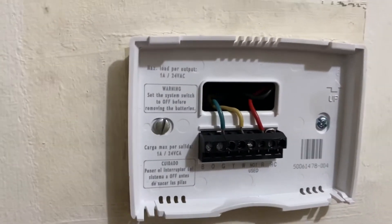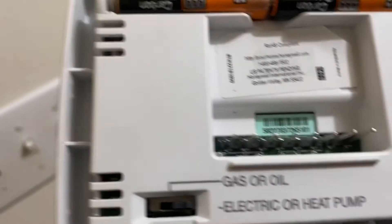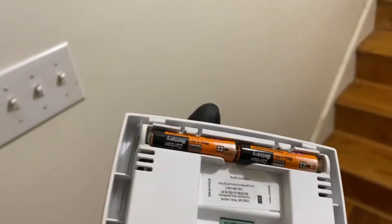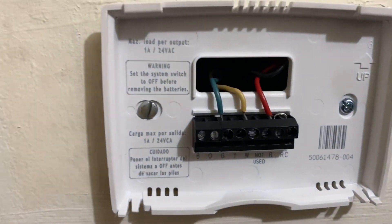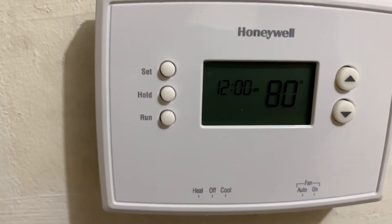It's not — not even close. They did something where the outside unit is running continuously. It's actually a heat pump, so that wiring is wrong. Do you have your old thermostat, sir? We may have to put that back. He not only wired it the wrong way — he wired it to give you heat. So he did something very fishy here. We're going to have to get to the bottom of this.